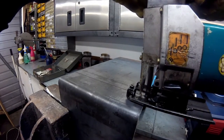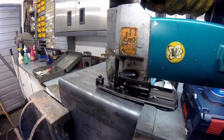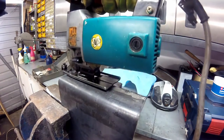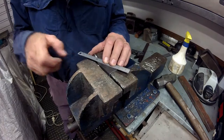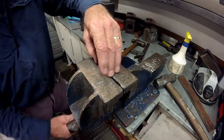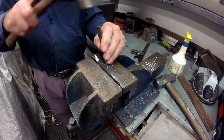I have bent up the basket using the full strip of material. When I have bent it to the final shape I then cut off the excess, again using the jigsaw. Earlier on I had cut out two 50 millimeter long lengths of angle to use as mounting brackets for the removable side strap, and here I'm marking a center on one side where I'll drill a hole to take the mounting bolt.